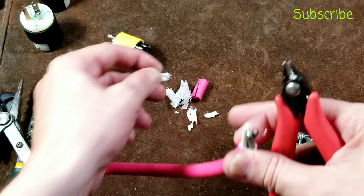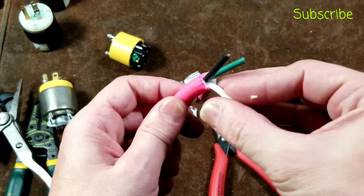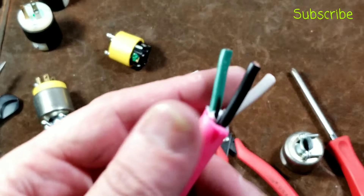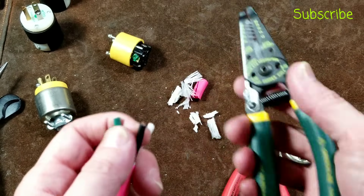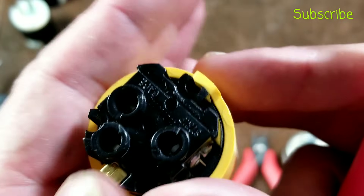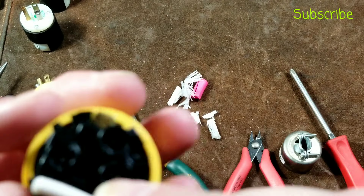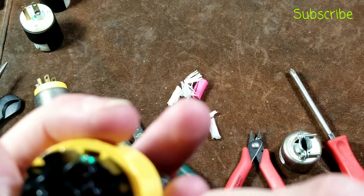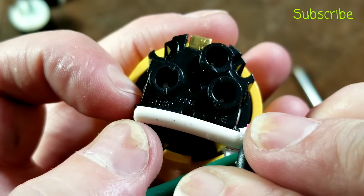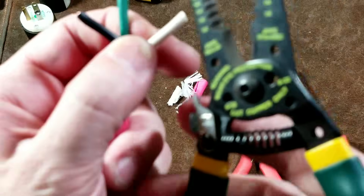And now we have our three little conductors. We want to strip these. You can use the strip masters or automatic wire strippers, but since you have so little space, it's difficult to do that, so we'll go ahead and use a traditional set. The second thing to pay attention to is most of these plugs actually have a strip gauge, which tells you to match the wire up to it. There's our gauge, and you can see that you actually want quite a bit of the wire stripped — maybe about a half an inch. This will be at the largest capacity.